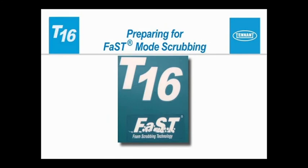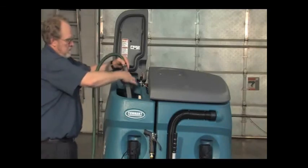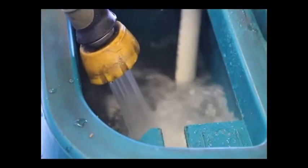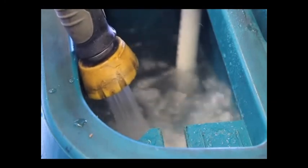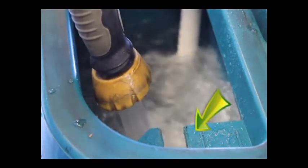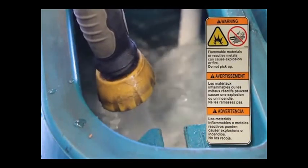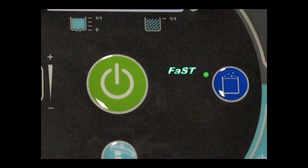Optional FAST mode. FAST scrubbing technology offers the advantages of using less water and detergent than conventional scrubbing. Unlike conventional scrubbing, the optional foam scrubbing technology or FAST mode operates by injecting the FAST pack detergent concentrate into the system with a small amount of water and air. To use this technology, fill the solution tank with clean, cool water only. The water temperature should not exceed 21 degrees centigrade or 70 degrees Fahrenheit. Do not use hot water or add any conventional floor cleaning detergents, or a FAST system failure may result. Fill the solution tank with water until the level is just below the indicator tab. Warning: do not use flammable materials in the tanks. Then turn on the key switch, press the FAST switch to enable the technology, and press the large green one-step scrub button to start scrubbing.